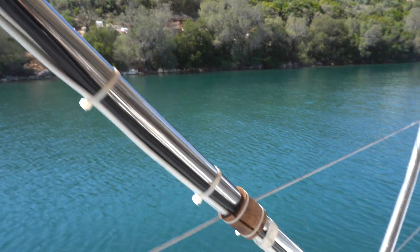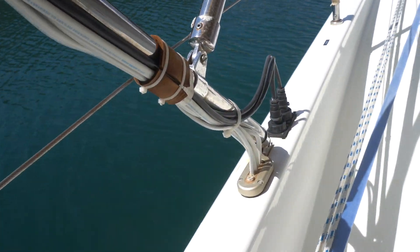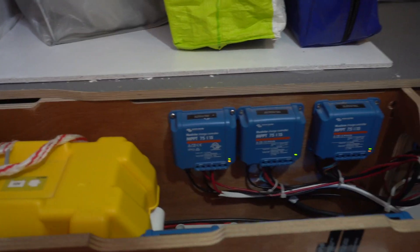This involves more wiring — we have separate pairs of wires coming down from each solar panel, running inside the boat next to our battery bank where I have my bank of controllers set up. It's not really that much more expense, because small controllers designed for one panel are not expensive. With nine panels, a single large controller sized for all nine would be very expensive, so I wouldn't worry about the controller expense — it's the wiring that requires planning.